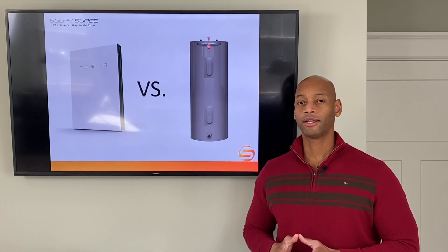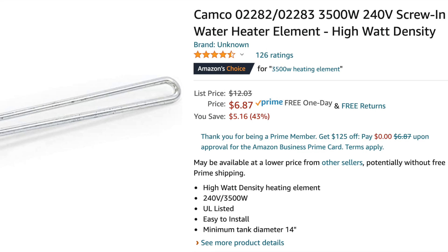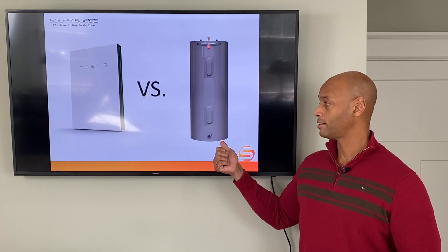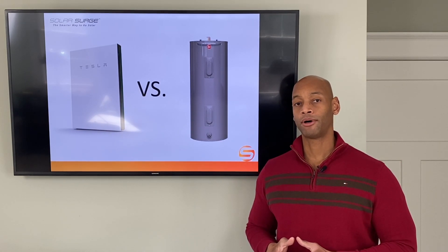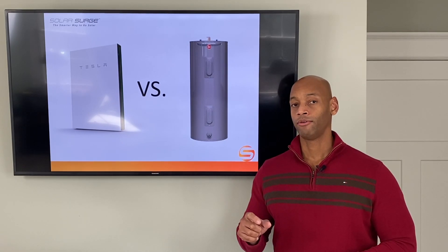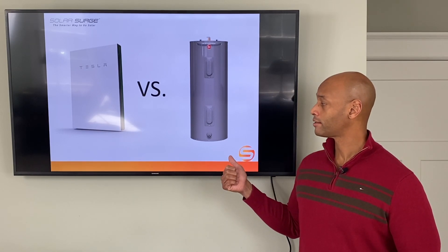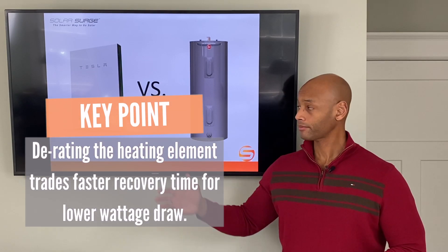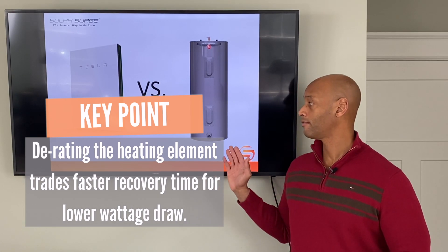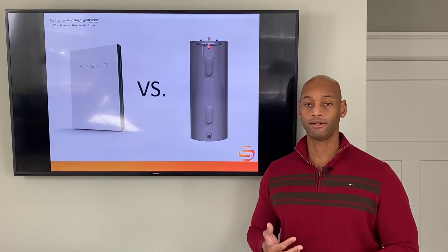You're going to want to look at the smaller 3,500 watt electric heating element — I'll put a link below where you can get this as well. It will require some minor maintenance on the water heater unit: we're going to remove the existing heating element and replace it with this slightly smaller 3,500 watt one. The good thing about the 3,500 watt element is that although it takes a little bit longer to reheat the water tank, it's a low enough draw that we can reduce the circuit breaker size from 30 amps down to 20 amps. That means only 3,500 of the 5,000 watts is used by the water heater, leaving you 1,500 watts for other things like your fridge, your TV, or your computer.